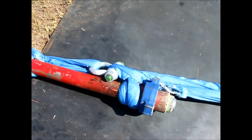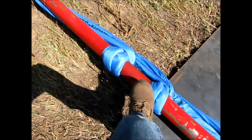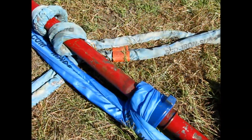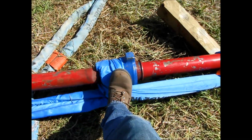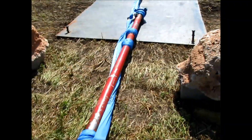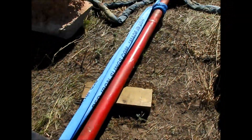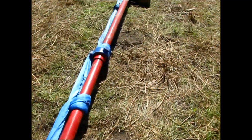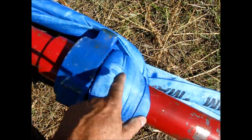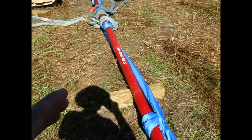In addition to that, as far as absorbing the load, look at how tight the half hitches are along this area here. That sling is very, very tight. This hitch right here, which is 10 feet from the separation, is probably absorbing the energy up to this area here. And on this end over here, it looks like the sling is very tight, all the way back to the second hammer union here, which would be 20 feet. It's very tight right in this area here. So again, we're still absorbing the energy in a 30- to 40-foot area, which really helps the strength of the restraint.